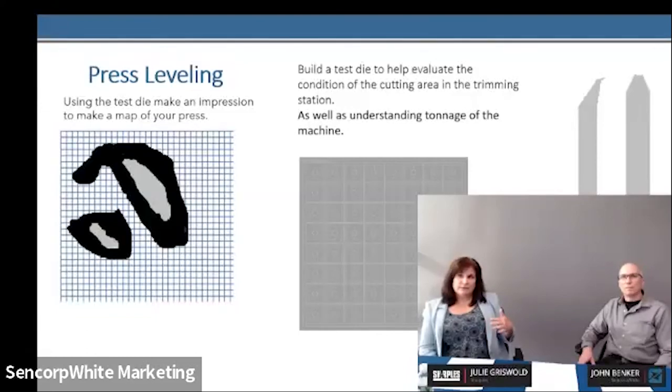You can see on the top right—you lose the edge of that cut and it's not going to cut properly; you're going to end up with angel hair. You need to preserve the edge of the knife. Also when you take it off the machine, we can't reiterate enough that you need to reblade the die. When that blade wears down, it kind of mushrooms out—you can take your nail and feel where it's rolled over a touch. The side bevel is very apparent, but the center bevel is a little harder to tell. Sometimes you can see some white ghosting and some wear.